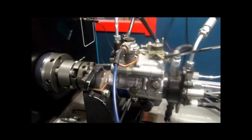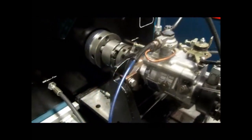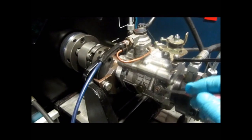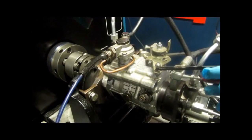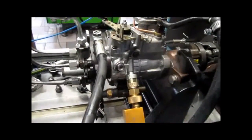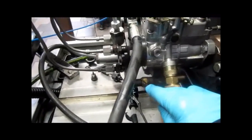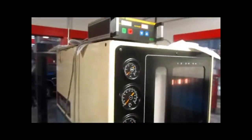This is the Delphi DP200 pump. I'm going to show you some options on this one. Here we have the latch valve for increasing the fuel at start boost controller. Here is the stop solenoid located. I take out the internal pump pressure in that one now. This is the electronic probe for the advance measuring. This is the wax solenoid for the advance, and here this is the test machine, it's a Hartridge 700.